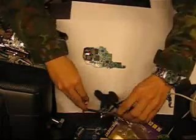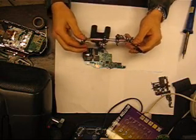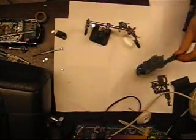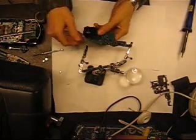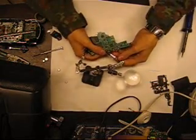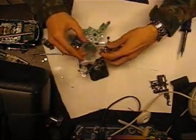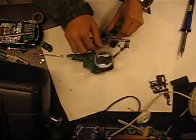To once again protect it even more, these clippy thong things on my little helping hand have been covered with electrical tape to prevent them from crushing or otherwise damaging any components or solder circuit tracks on the main board. Now we attach the main board to this little helping hand stand so that we don't have to hold it by hand during the soldering. The system also has a magnifying glass that will greatly ease our job, allowing us to see the object a bit bigger whilst desoldering it from the main board.